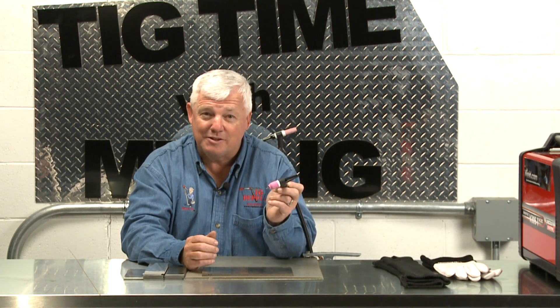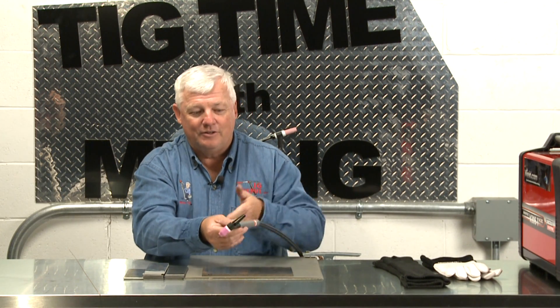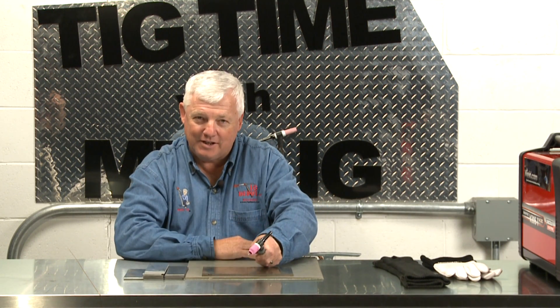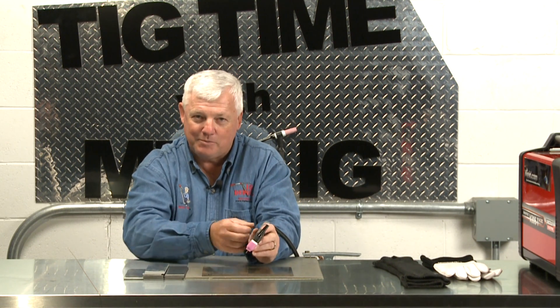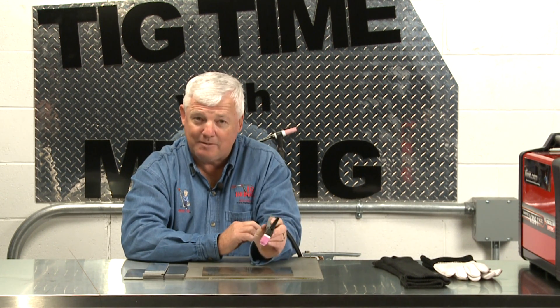In this segment we're going to show you the three mechanisms that you need to do to make a good TIG weld. One of them is you need to have a good TIG torch. In this particular TIG torch, I want you to hold the torch like a pencil. You're used to MIG welding — that other process — and holding it like this. So I want you to remember always to hold it like a pencil, and the reason for that is you're going to be manipulating, getting into all kinds of tight places.